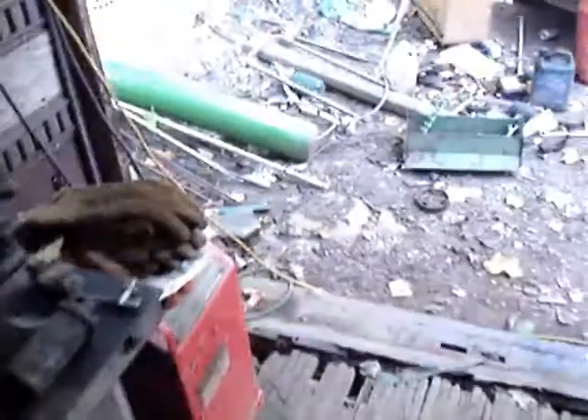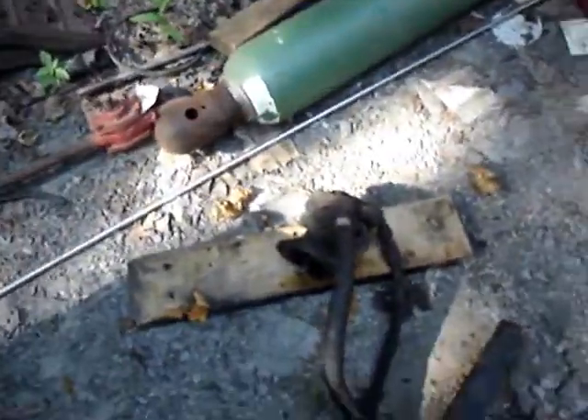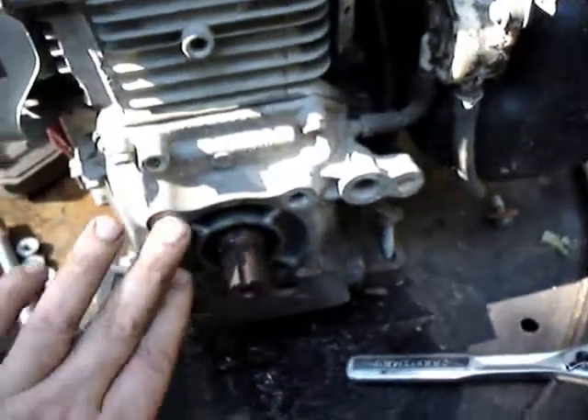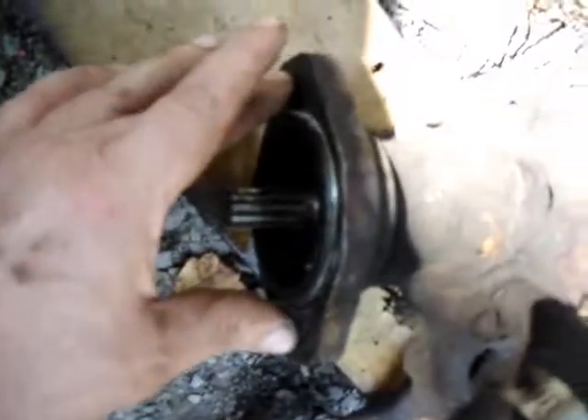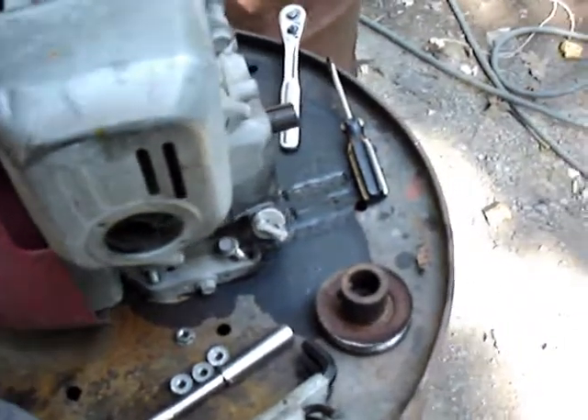I did something with it — something stupid. I'm not sure where the heck I put that thing. Anyhow, I got a nice little spline piece that belongs on that pump. I can put one end of the Boston coupling on the engine, and once I find that spline piece, I can weld that to the other end of the Boston coupling, and make sort of a teeny little bell housing to bolt up to the face of the engine. The other end will go right on these two bolt holes, and everything ought to be nice and happy. If I could find that spline piece — and I don't even have the Boston coupling yet. It proves to be a pain in the end.